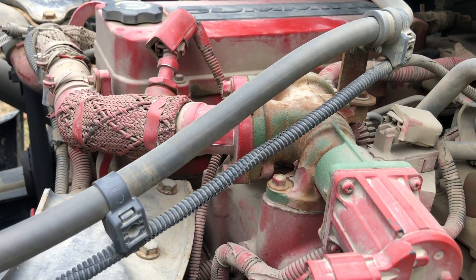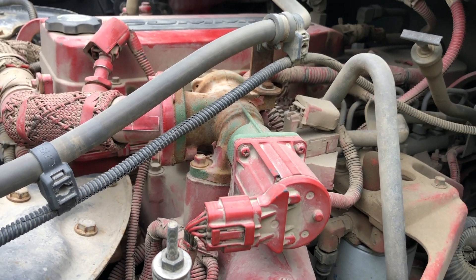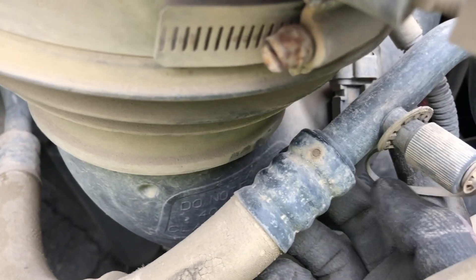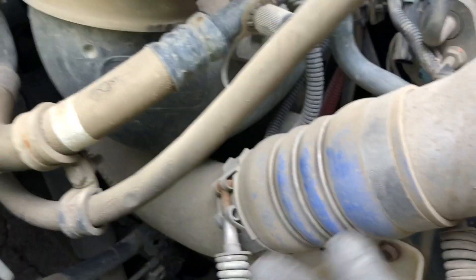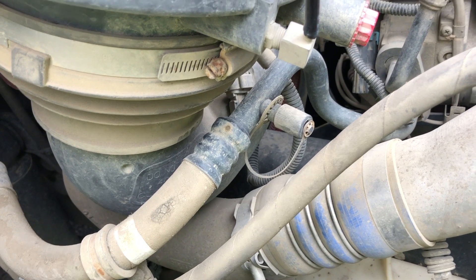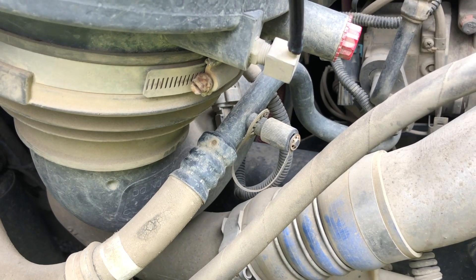All the knowledge I've acquired is from Cummins QuickServe — put any questions in the comments below. In the intake you have the barometric pressure sensor right here. You'll find it in all Cummins engines — it looks like a MAP sensor but it's designed to measure atmospheric pressure and intake temperature to send data to the engine. Depending on altitude, the barometric pressure reading will vary.